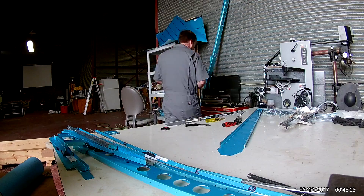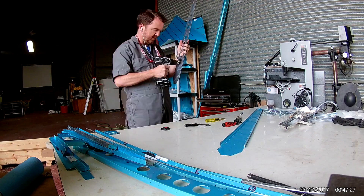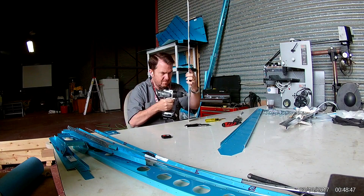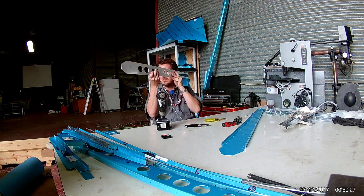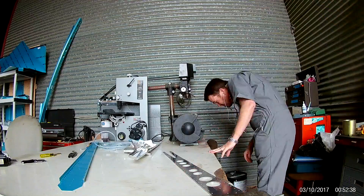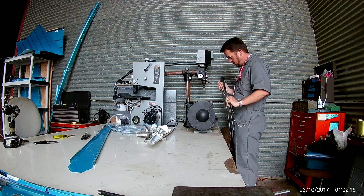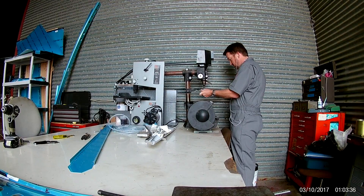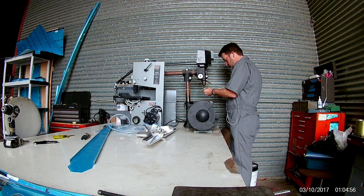So those bar doublers are very thick — 0.125 inches, which is an eighth of an inch. You need to deburr the edges so that the original stamped edge is gone and there's a slight over-round on all sides. As you can see here, I've switched cameras — now I'm on the other side of the workbench and I'm using a combination of a bench grinder and a scotch-brite one-inch wheel mounted on my drill press.